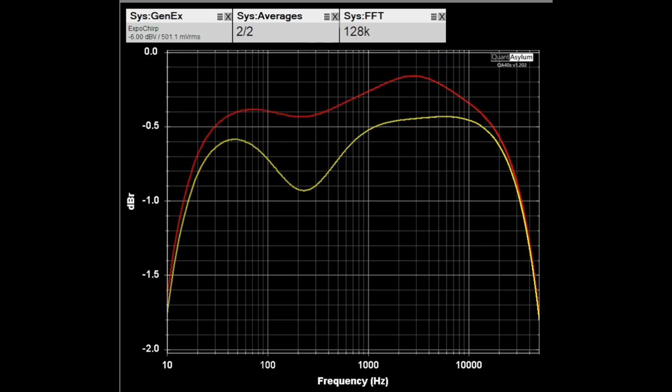Okay, let's just focus between 20 hertz, which would be this line up here, and 20 kilohertz, which would be the line right here. So we are basically within a half a dB of the 0.5 dB line, but remember we started off out here at 0. So it does affect the response a lot with the equalizer switched in and the controls set to 0. I would say it affects it almost a dB here around 250 hertz, at least for the left channel. The right channel it does not, but it does have an effect. So if you didn't want any equalizer effect at all, you would leave that equalizer pressed out, of course, but then you could go in and tweak it, and I'll do some tweaking of the equalizer controls in a different section of the video.